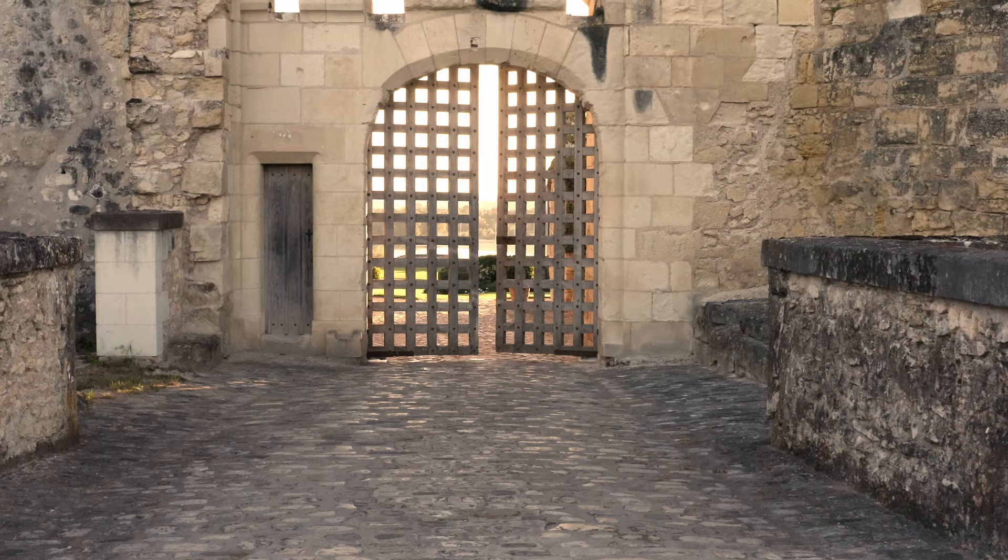We have welders in our shop, so we're able to custom fabricate all of our gates using square tubing. In a case like this, one of the first recommendations would be to split it into two gates — a double gate whenever possible on big gates. This is one continuous long gate, not a double. Also, that's a lot of wind load — something people forget about. Even a light breeze can enact a lot of force on this particular gate.